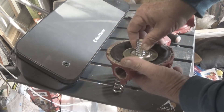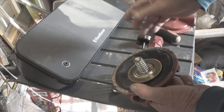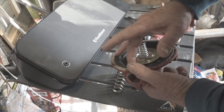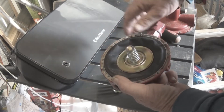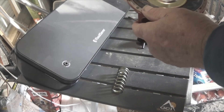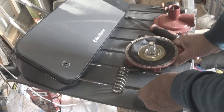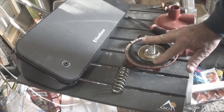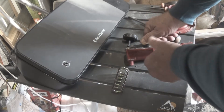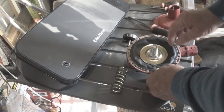The manufacturers of LPG products recommend that these regulators be changed every 10 years because the diaphragms get worn and could leak. I concur — that's a good idea and I do follow that policy every 10 years. Since this tank is very old, I've already replaced it, and it was not terribly expensive.